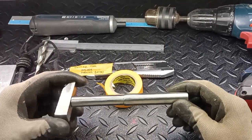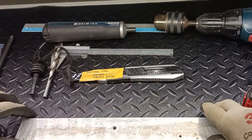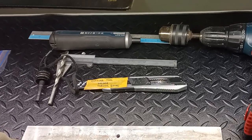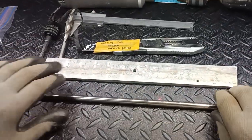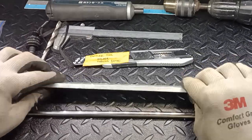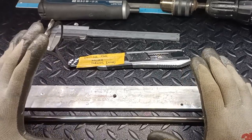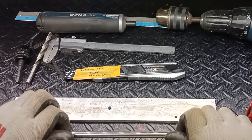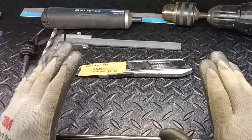You will be given a raw material of a cast iron block and also a cast iron cylindrical bar. This bar is just for illustrative purpose. You have to mill and lathe it according to the engineering drawing provided. I will briefly explain how the handlebar can be fabricated using a typical lathe or turning process. A lathe machine does a turning cut to produce cylindrical workpieces such as shafts, bearings, bushes, and similar components.